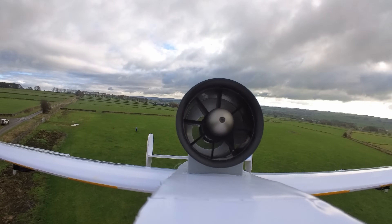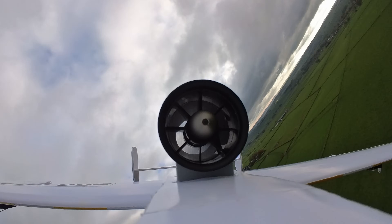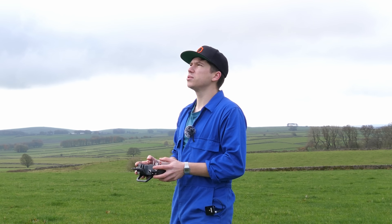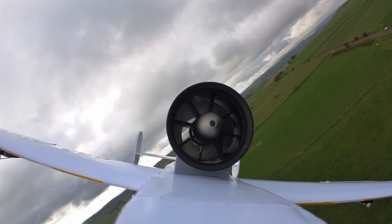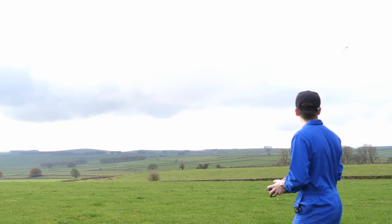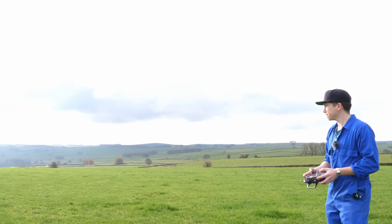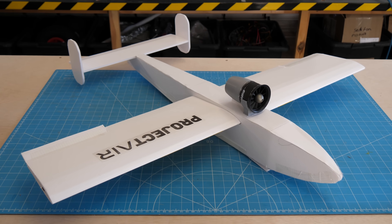It's up in the air. It's flying. It's climbing. It's doing all the things an aeroplane should do. I was just trying to use the rudder, but forgotten that I hadn't got one. I think I need less roll authority — a bit of down trim. It could do with a rudder to bring that nose round. Still, it's flying very nicely with lots of manoeuvrability. Let's go for a high-speed pass. Flying very nicely — I think we can scale this thing up. Very nice indeed. So the 50% scale electric prototype flew very nicely.